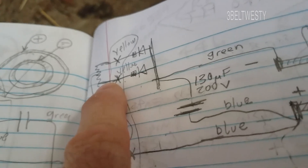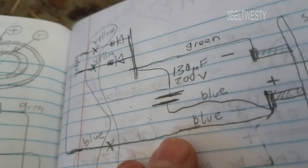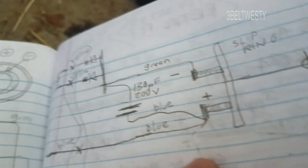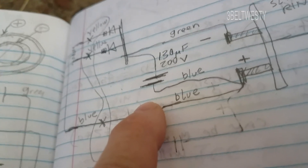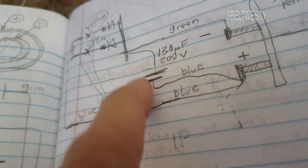I'm going to run this with everything accessible from outside, just to play around with measuring and back-powering it with DC as an experiment. In an earlier video, I only got about 110 volts at light load instead of roughly 120, and this capacitor in mine is bad.